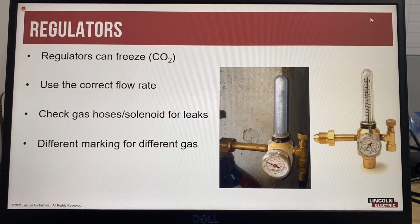Some welders may not realize there is a problem with the shielding gas until they remove the slag from the weld and see porosity. Sometimes the weld can still have a good surface appearance, but there will be internal porosity, which will only be found after the joint is fully welded and final inspection is being conducted. That will become a repair and a quality issue.